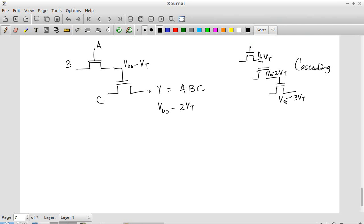So there are families where, for example, there are multiple levels of voltages, one for the gate, one for the drain, and so on. Okay? But it's a problem because you need to now make sure that you are routing two different voltages across. You use the correct voltage at the correct place and so on. Okay? Now, VDD minus VT I can live with. VDD minus 2VT is a problem. If I say that, then how will you solve it?